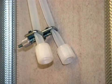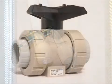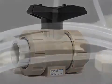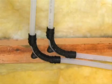The AquaTap has a complete range of components to aid in installation. Each faucet comes with an emergency tube clamp to isolate the faucet should service be required or to move the faucet in the future. The clamp will not damage the tube, which will return to its original shape once released. An isolation ball valve can also be ordered in either polypropylene or PVDF materials. Tubing is available in either PE or PFA. Corner brackets help prevent kinking and should be used for changes in direction.